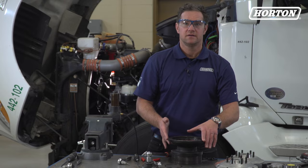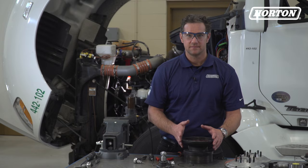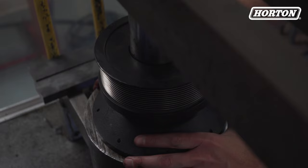Then we just slide the pulley and bearing assembly off the journal bracket. When you do that, make sure to wipe away any excess grease from the pulley. Now it's time to rebuild. Make sure you fully support the pulley and press the bearings out of it. These bearings will be discarded — a new DRAC bearing is provided in the kit.